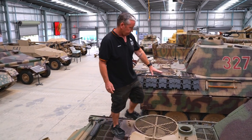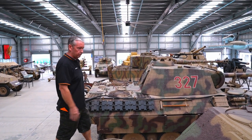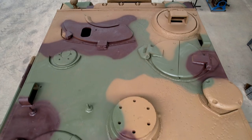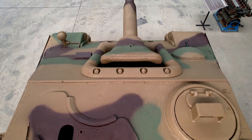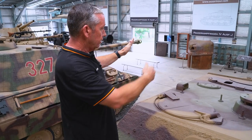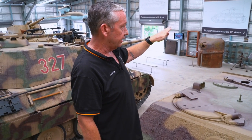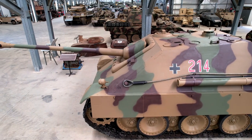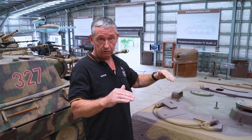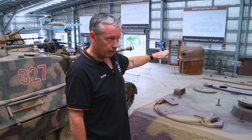A minor change: the antenna mount from the Panther A has been moved up to the back of the casemate. When the first prototype was shown, the traverse left and right was 11 degrees either side. When it went into production, it came out with 12 degrees either side, giving a fairly good arc of shooting. To keep the vehicle as low as possible, they started with wanting negative 10 degrees depression and up to 14 in elevation, but reduced that to negative 8 degrees depression while keeping elevation at about 14 degrees.